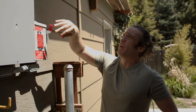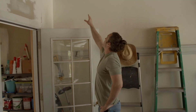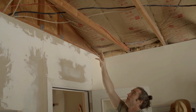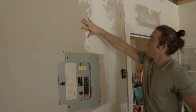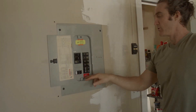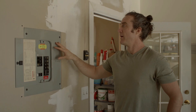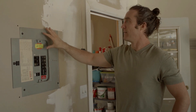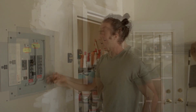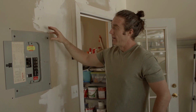That's one thing Oryx Solar does a really great job with. From here, let's go take a look at the electric panel where this routes back into, because that's how it hooks back into my house. The next piece along the path is this conduit running back up through that hole, down into my wall unit, and finally tying into just my standard electric panel. You do need to have an extra slot on the electric panel, although one nice thing about Oryx Solar is that if you don't have any more space or your panel needs to be upgraded, they do that for you — it's part of the package price and doesn't cost any more. They consider that part of your solar panel installation. I'm tied in here on just a standard 240/220 line.